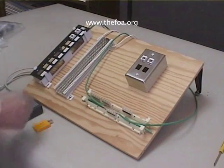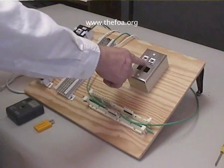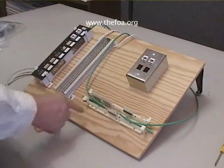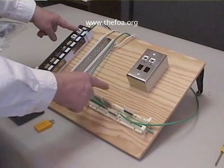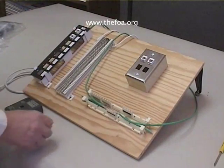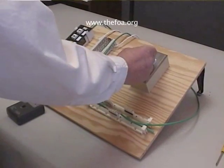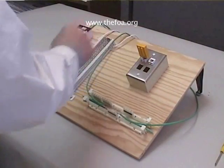After you've completed wiring your Category 3 through the 66 block from the patch panel to the outlet, and your Category 5 through the 110 block from the patch panel to the outlet, then we can test it. The way we do that is we take the terminator and plug it into the outlet.